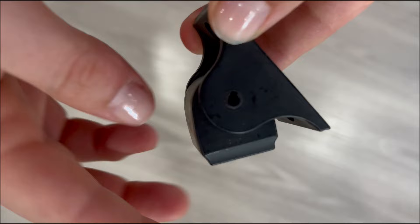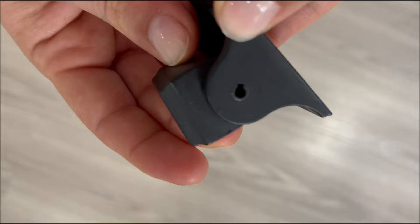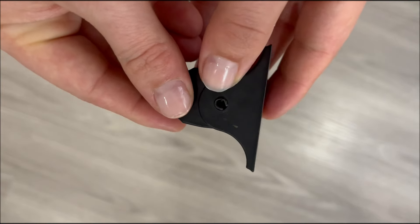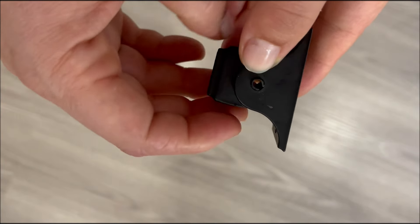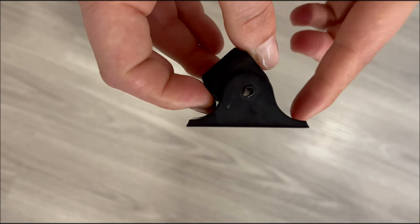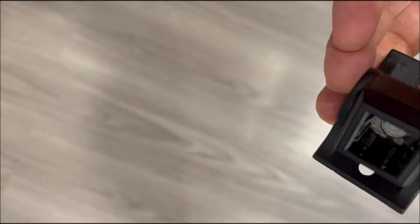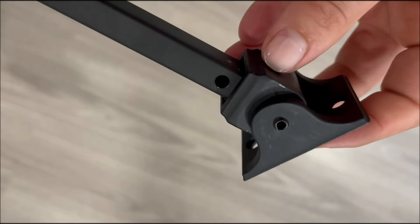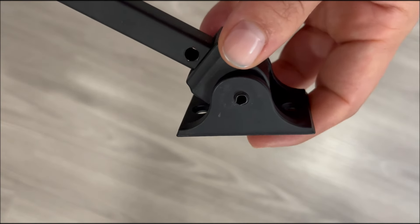But we have these adjustable ones that will be used at the top. What's really great about these ones is that you can adjust them as you go. So if your angling is slightly different on your railing, each one will adjust exactly where you put it into place. This is going to be a deeper one — it'll take into effect when we're measuring and cutting the balusters. On the inside it has that grooving, so the metal is going to go in, you hold it straight, and then you hammer it into place and that grooving holds it solid.